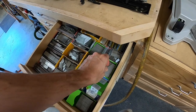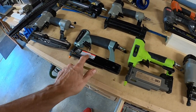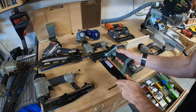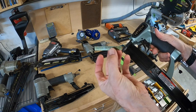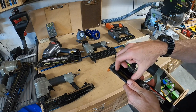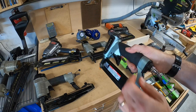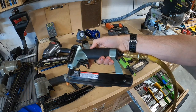To give you an idea of the pin size — this is 3/8ths of an inch. It is puny. I'm not sure if I can shoot a 3/8ths in this gun since it says 5/8ths inch minimum, but I'm going to try it. When you load the pinners up, you have to make sure your arrow is pointing down — that's where the point is. It's hard sometimes to know because they're so small; these things are like needles. Put it in, make sure it's pushed all the way in, then hook it up to the hose. Now this thing's ready to fire.